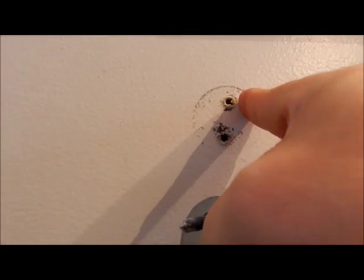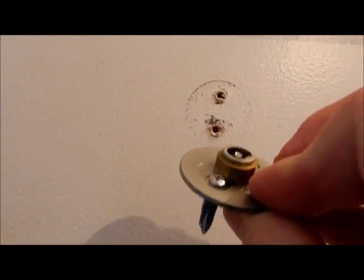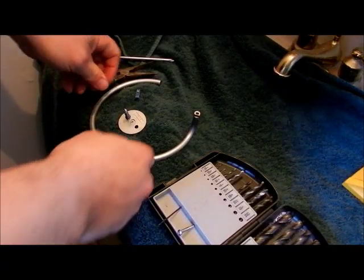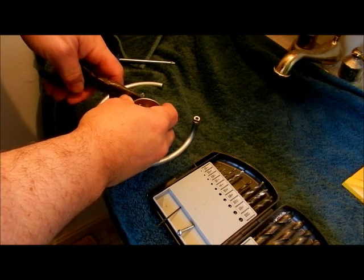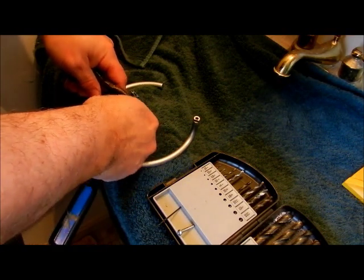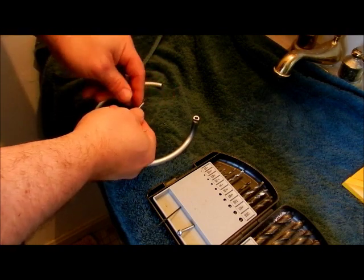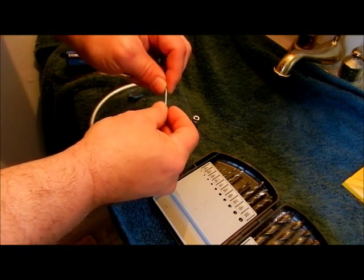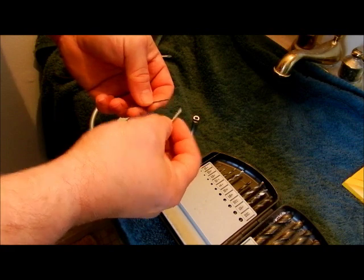We want to take these things off. We're going to drill two holes into the stud and put this in the right way. We're going to lock the set screw down, and we'll use Loctite to keep it in so this thing never comes out again unless we really want to take it out. I already took one of these out to make it go a little faster. It's hard to grab and turn, so I'm using needle nose pliers. Get a good grip — don't squeeze too hard — and we're just going to spin the screw out. We need to draw some dots where our holes are going to be.